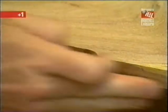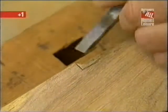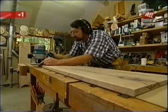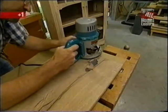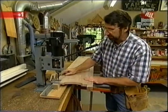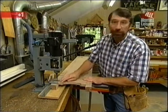I stopped short of the end with the router and will square up the corner with a chisel. I'm also easing the edges of the top using a portion of a quarter-inch rounding-over bit. With the glue dry and the clamps removed from one of the panels, I'm drilling the mortises for the ironwood pegs. Had I done them earlier, the holes would have filled up with glue.